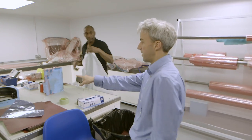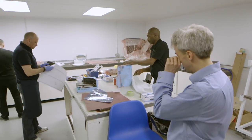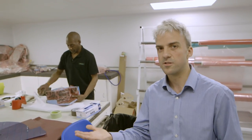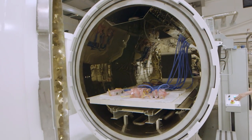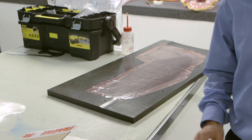Moulding is going on over here. Pieces of pattern block — the blue material — are used to make tool surfaces that are then laminated onto to make moulds, which are then typically used to make the components themselves. That'll be cooked in the autoclave. This kind of surface finish is what you get once you've finished that process and it's all cooked.